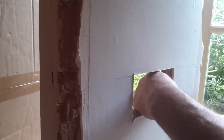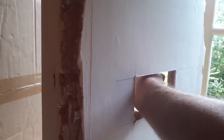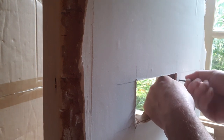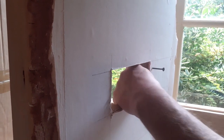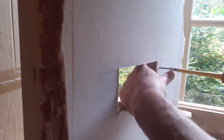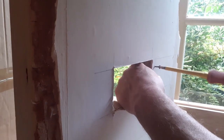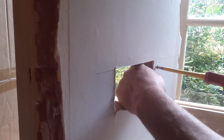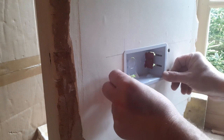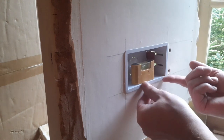This is all dependent on how thick the plaster is, because there's only a certain amount of depth in these plasterboard boxes. I'm using the really deep ones — the 47mm boxes. Just line up the screw with one of the laths, hold the support at the back, and then just gently with a handheld screwdriver screw through the lath and into the support. It just gives you a little bit of extra strength. Use a handheld screwdriver — if you start using a drill driver you're just going to blow right through. You can see the support held in there nice and tight with a couple of screws — plasterboard screws. Put the box in and see if it's level.